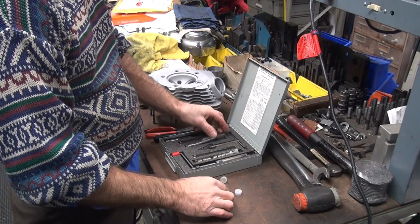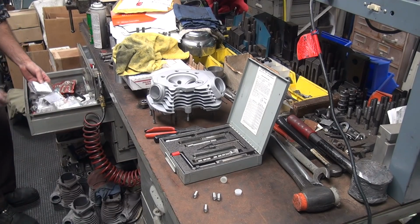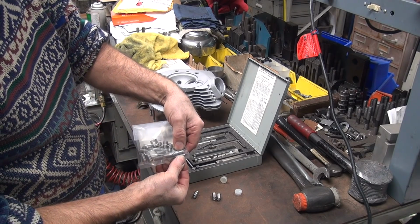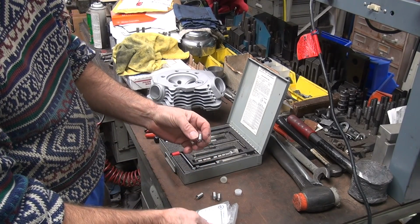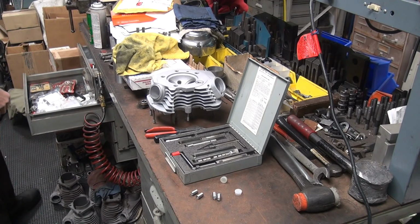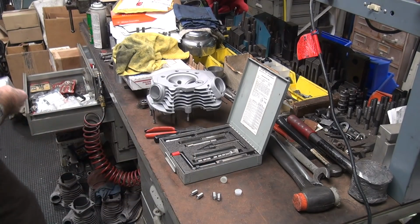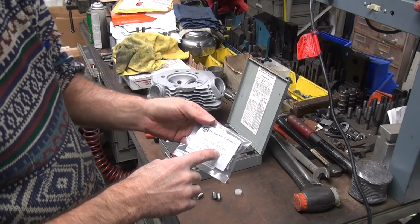I keep buying more and more of these every time I buy them. These are 2.5 diameters here, which I think are what these are. This is a 2.5 diameter. That's what 2D means. So these are 5/16, so 2 diameter would be 3/4, and another half diameter would be 7/8 probably, or something close to that. And overall length. No, that's wrong. 5/16 double is 5/8 of an inch. And 781 is total, just about 3/4. So we need something that's 5/8 in length. Something like these ones right here. 625.